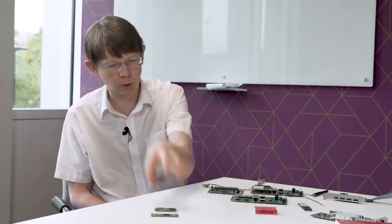If you don't want USB 3, you can use that for your own applications. Also in the corner of the board is an onboard power supply. So the CM4 now needs one 5-volt power supply rail to power the whole module. Previously you had to provide at least 5 volts and 3v3, and there were some sequencing requirements. This is just 5 volts in, so that again takes silicon away from your final product, and it's all captured on our module.